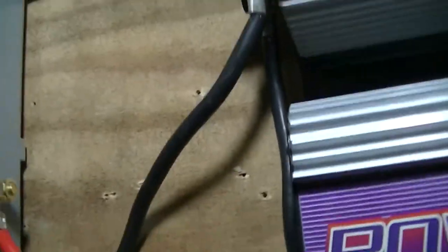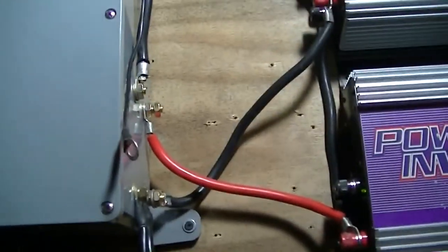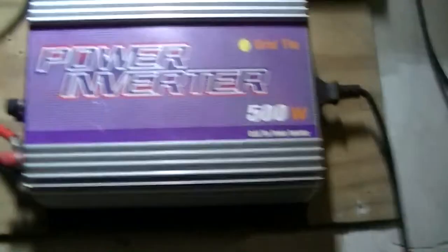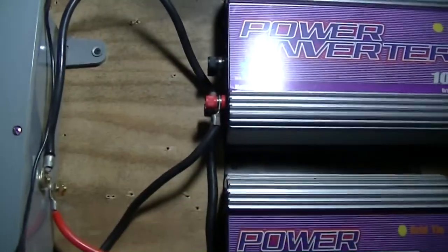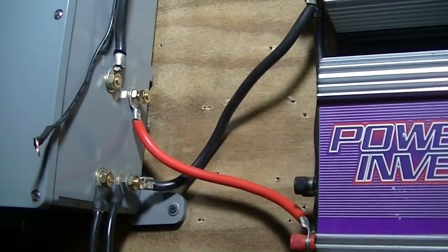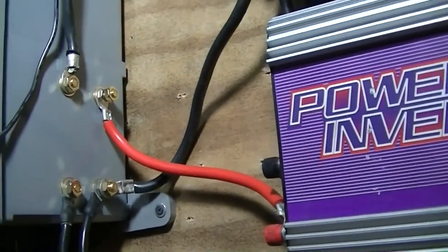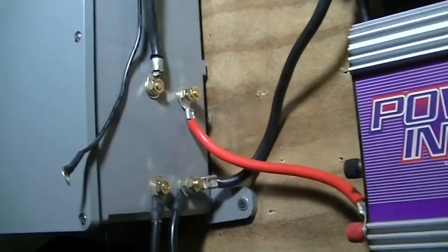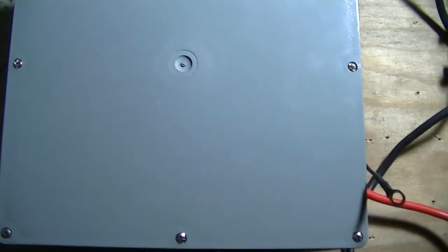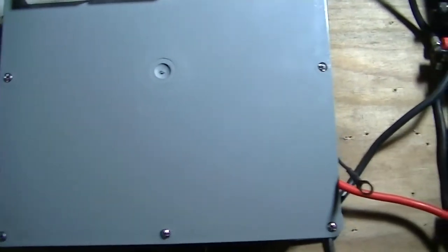Since I'm home, if we lose power I'll come out and put the seat clamps on the rectifier and shut the turbine right down, or hook it up to the battery bank. So anyway, just like the way it was set up before — I have that golf cart voltage reducer, a 24 to 60 volt input that drops down to 12 volt 10 amps. That's inside this box. I have a 48,000 microfarad electrolytic cap inside — I think it's 60 volt — and that relay is also inside this box.